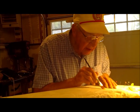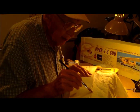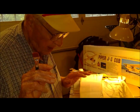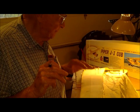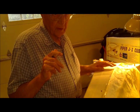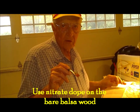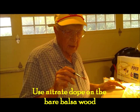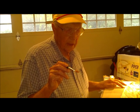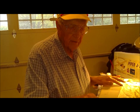Make sure you got all of it covered with nitrate dope. Remember, you can cover nitrate dope — airplane dope — with butyrate dope, which is a finishing coat. But you can't cover butyrate dope with nitrate aircraft dope, because that won't stick to that. So that's one thing you have to remember when you're using this method of covering airplanes.